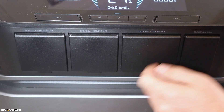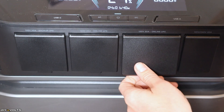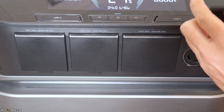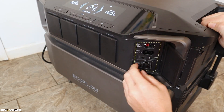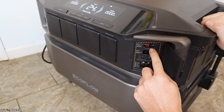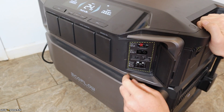Over here, there's a 120 volt, 30 amp online UPS. If you can see here, it's got a typical 30 amp, 120 volt plug for like an RV. And then over here, 120 volt and 240 volt — so it's a split phase, and you can pull either 240 or 120 off of that. If you open this up, it's got the 12.6 volt, 30 amp max DC output port — it's an Anderson plug — and you've got your low PV port, 30 to 150 volt DC. You can plug that up to have your PV coming in. And then down here is your AC charging. You can do a fast or a slow charge, and the slow, I've noticed, is about 600 watts.